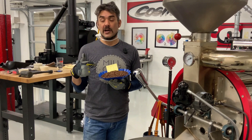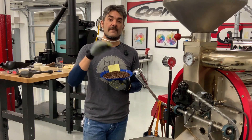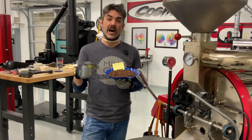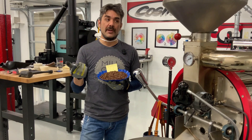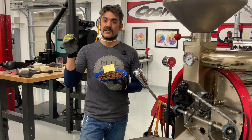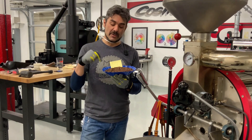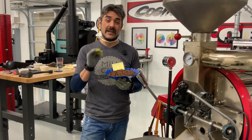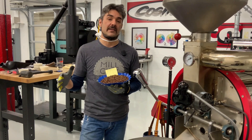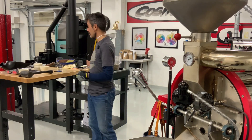It's a very small Vietnamese coffee — the beans are tiny, smaller than the smallest beans that had already fallen through the gap last week. That tells me this coffee will not work in the current drum gap. So for quality of cup I should bring the gap forward, so I won't have chaff fires that could potentially add a little note of smoke to my roast today. And because I'm roasting this small coffee, let's just make sure we have a really nice drum gap so we don't have issues with rub or bean drop once we get into roasting it. It's just a good idea to get that knocked out ahead of time.